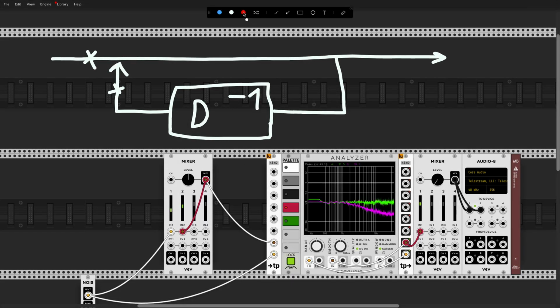So notice that we have those elements here. We have two glorified volume faders called coefficients. We definitely have those, so these are over here. We definitely have a feedback path, right? This is over here. Now, what about this delay? Where is that delay? And the answer is, it's actually everywhere. You're looking at it. It's over here, it's over here, it's over here.